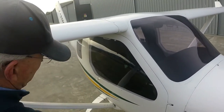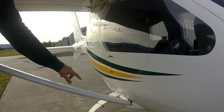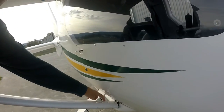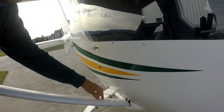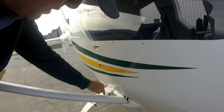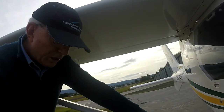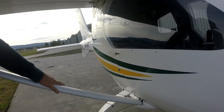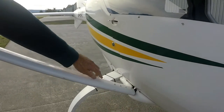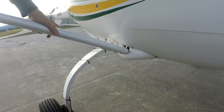Check for any apparent damage or things that are loose. Before we move past here, we'll check the wing strut bottom — the wing strut is pretty important in holding the wings on, so we want to make sure all this is secure. This is where you'll see smoking off fittings that are loose, because we've got an aluminium strut with fasteners into it. If anything has come loose it starts to oxidise and rub, and you get that distinctive black. So it's indicating that it's loose, or there's corrosion, or both. The screws are really tight, so there's no sign of anything like that.